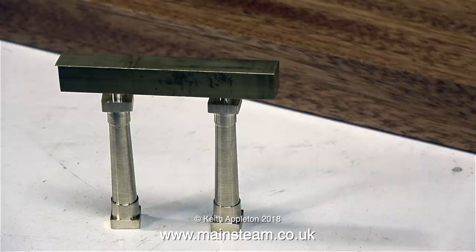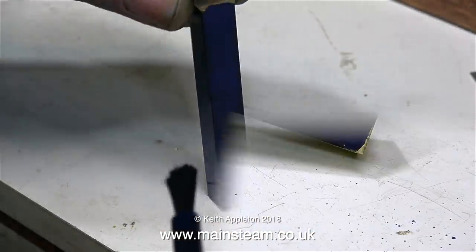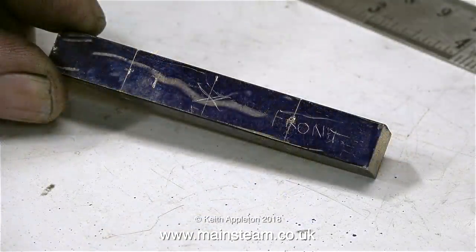And here they are — it's like an upmarket version of Stonehenge now. Relax, it's not painting time. I'm just coating this piece of brass with engineer's blue that was kindly sent to me by a man called Norman. And now not only can I see my marking outlines, I can write on the parts to tell me which way round they go.